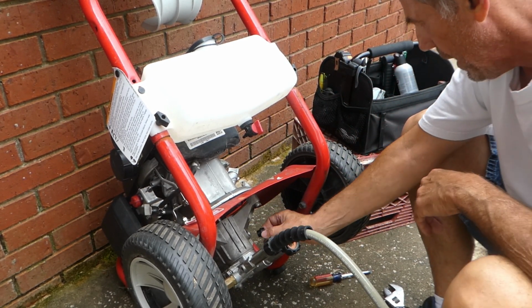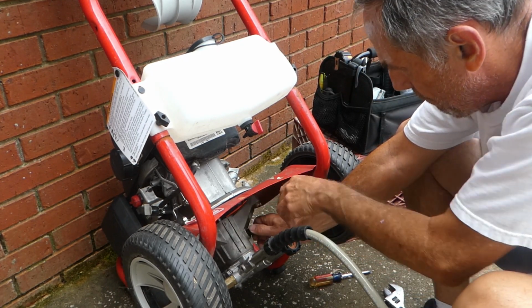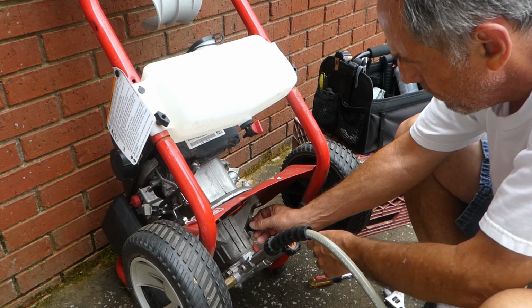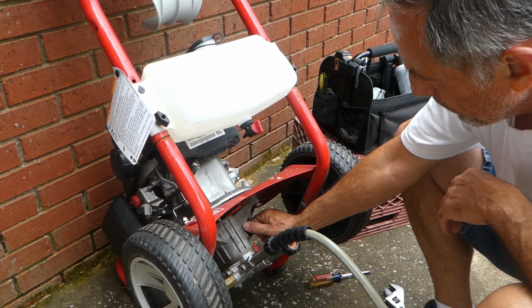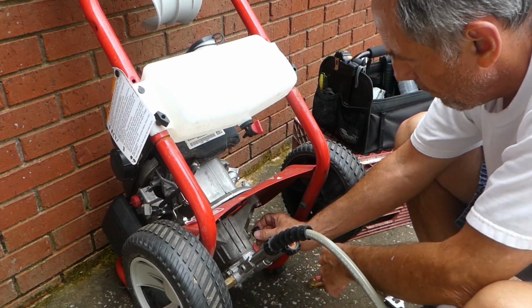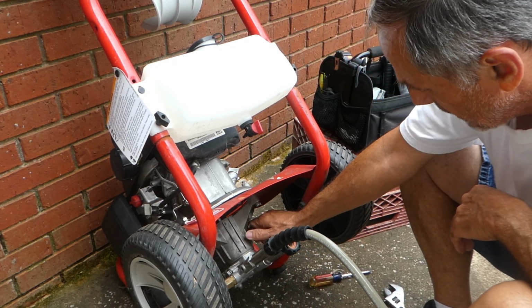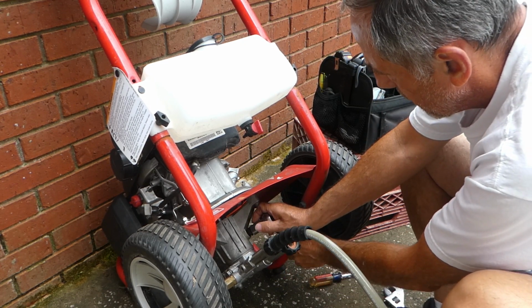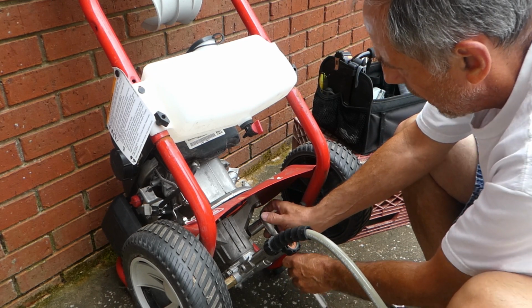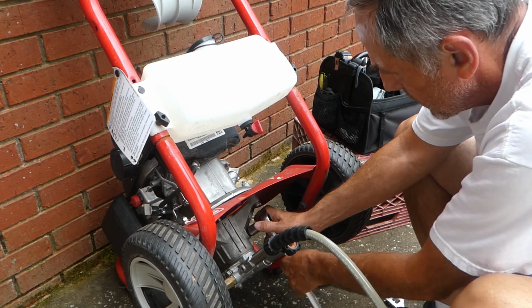And it looks to be fine with plenty of lube. But after you get past that drive is when the pump itself, and you get into the pump. It mounts up on the bottom of the housing there. But that's where we have our oxidization as well as lubrication problems. You want to make sure you lubricate that thing every once in a while, which I must admit I've neglected that part of the process.